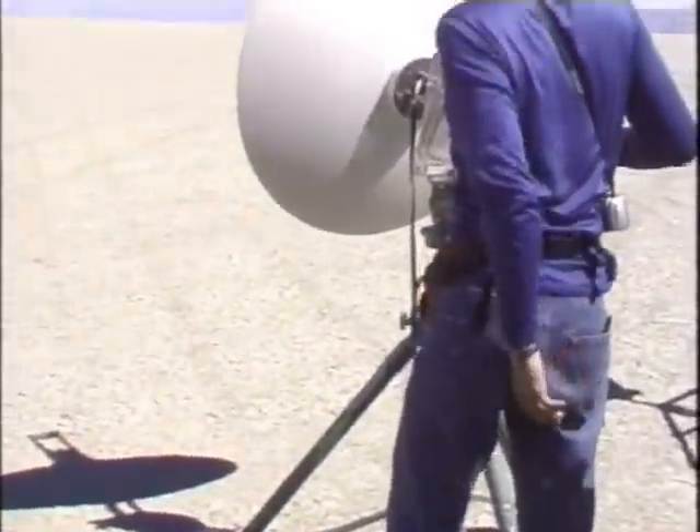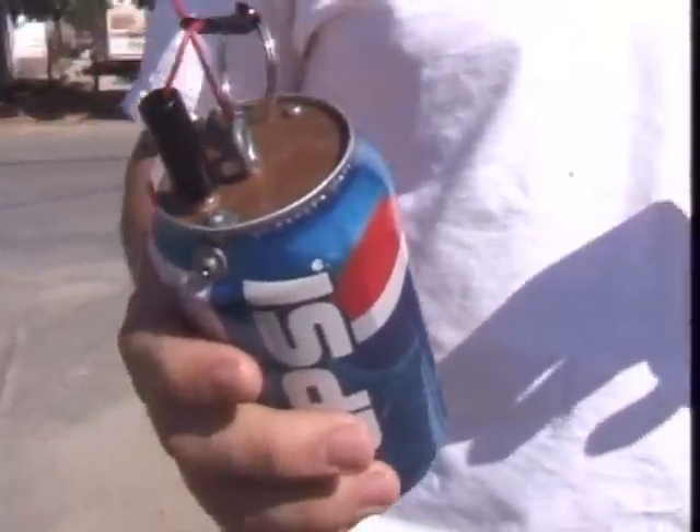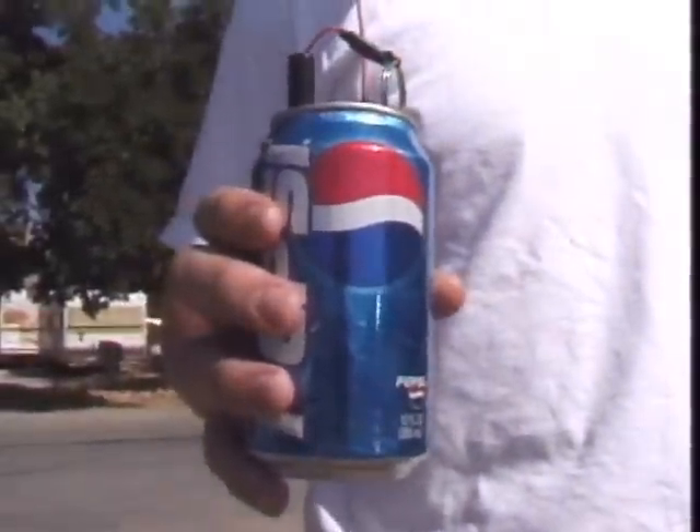It has real-time video, and so we've actually got a VCR with our imaging ground station — it will be taping it. There's also a thermistor inside, and it will record the interior temperature, just a health indication. A cansat was built to transmit temperature data back down to the ground station. It just has a transmitter with a little circuit built inside it that basically sends a bunch of tones to the radio.